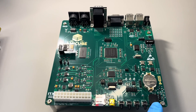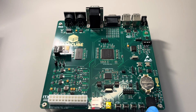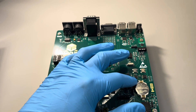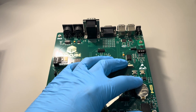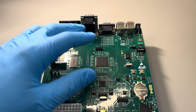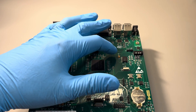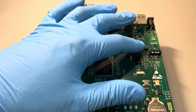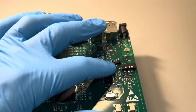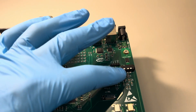I tested the tape in with the Sinclair — ZX Spectrum — so you can actually load games from your original tapes, which is awesome. This board also has a real-time clock; this battery is for the real-time clock, the chip is here. There is also a little flash that has the firmware necessary for Amiga and Atari to understand all this. Then there is audio out, and also a header for audio out so if you have an ATX case you can have a cable and audio jack on the case instead of on the side.